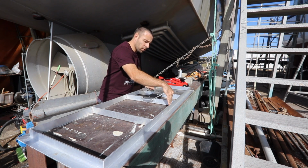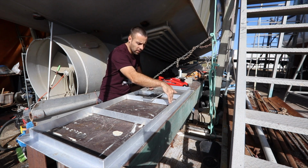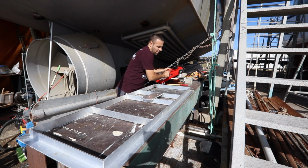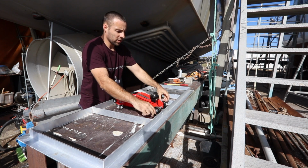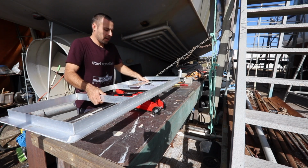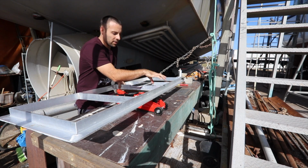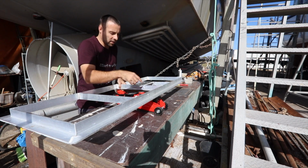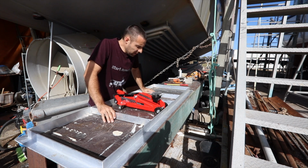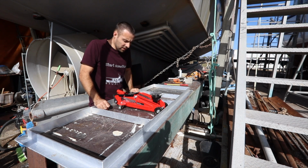My plan is, I've got a vertical that I have to essentially bend against what it wants to do. This bit here will bend easy, I'm not worried about that. It's this bit here that I have to focus on. So I'm going to use this hydraulic jack. I'm going to build a little jig that it sits on so that it'll hold. Actually, it'll go the other way around, because it's going to bend it the wrong way if I do it this way. It'll be basically like that, with something that'll hold it on either side that'll go underneath the jack so that the jack will start squeezing it apart. Might sound a bit odd, but it'll make sense once you see what I'm doing. So we'll get stuck in, we'll come up with a couple of prototypes and see which one's actually going to work.